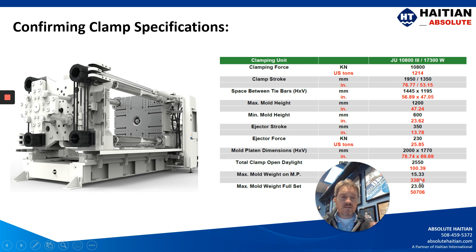As well as your mold weights — maximum mold weight is another topic that should be discussed, especially when you get into larger machines above 500 tons. So these are the basic specifications that your machine supplier is looking for you to provide them when asking for a quotation.